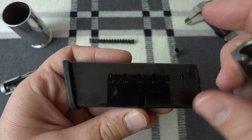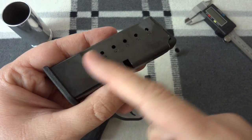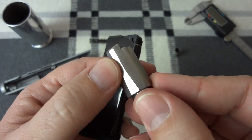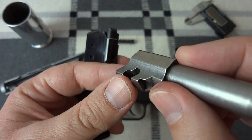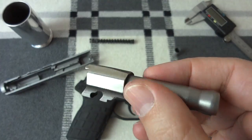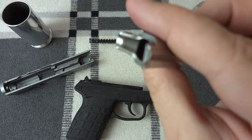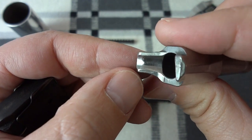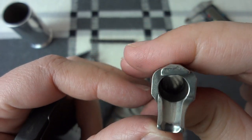You wrap a piece of wood with a cleaning cloth down into a vise, then impregnate the cleaning cloth with a little bit of polishing powder. It does pretty well. You can wrap pencils or little dowels with a cleaning cloth and get all the areas on the barrel. I like to do that because it looks better with the polish, it's easier to clean, it won't stain as quickly, and it lasts longer. I did the same thing with the feed ramp using a dowel. You don't want to take any metal off necessarily — you just want to change the finish. I think I used Flitz for that.